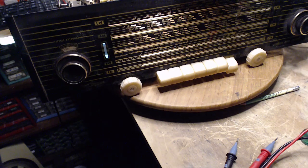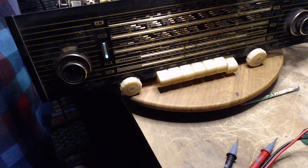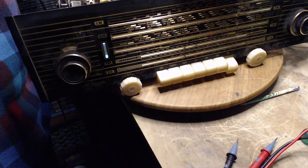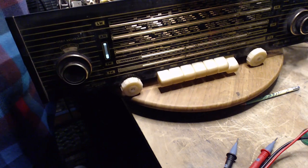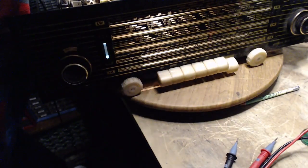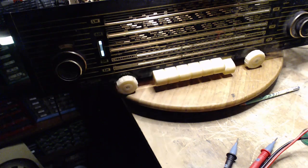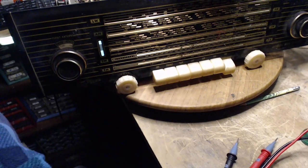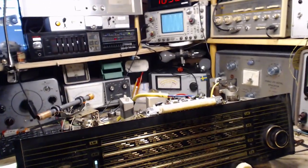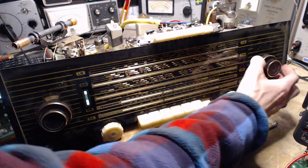So I'm going to, we can leave the signal generator going. I'm going to try to reconnect this antenna, and this will probably cause the signal to go way up. Gone way up now. And you can see on the scope too what it's done on the scope. Give you an idea of the audio level. Full screen. Now we're going to find a station to compare.